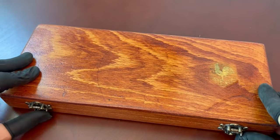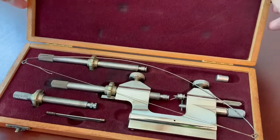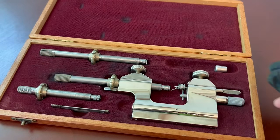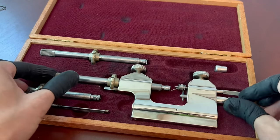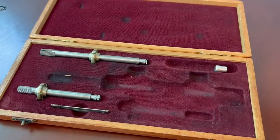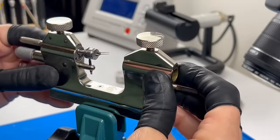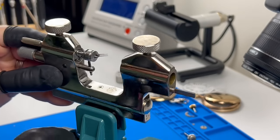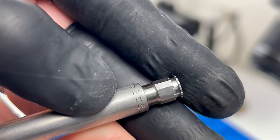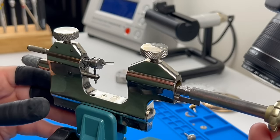The jacot tool is a bow-driven manual lathe for filing and burnishing pivots. The main goal is to work a pivot that is worn or damaged to one that is nicely shaped and cylindrical. From a pivot that causes friction with its bushing or jewel surface, to one that is polished and low friction. The jacot drums attached to the various tailstocks are numbered, representing the desired pivot size in hundredths of a millimeter.